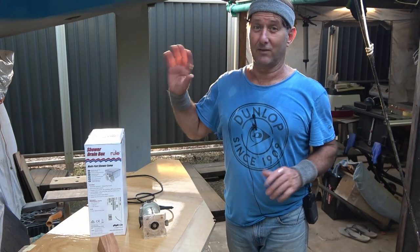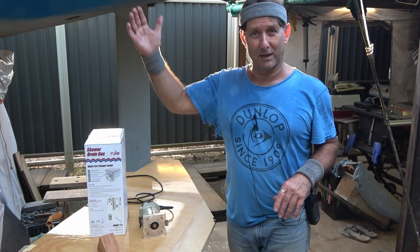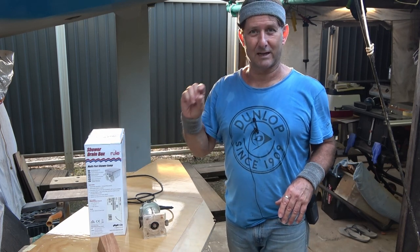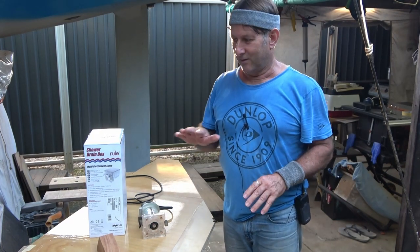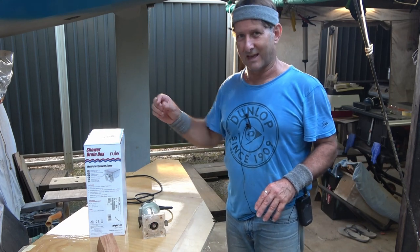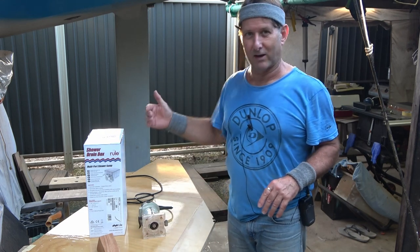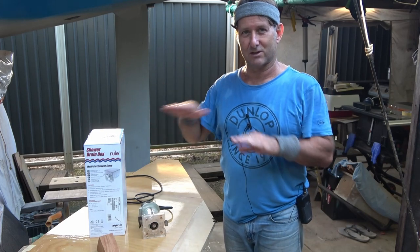The second reason is, in the unlikely event that any water might be coming down the hull and then need to make its way to the bilge, having that rounded off just makes a slightly larger gap, which I thought is just a better idea. But saying that, that edge does not actually touch the hull. I did make it so that there's a gap because I didn't want any contact between the sole and the hull wearing paint off. But I think just rounding that off will make a nice, neat gap. The top will remain where it is, so it'll give the width.